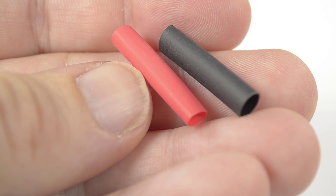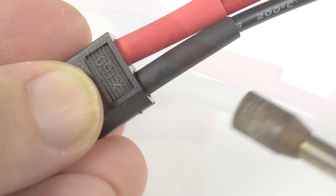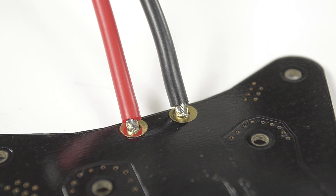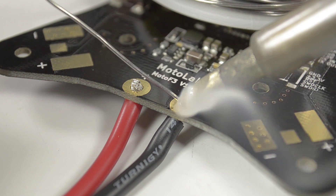The joint should be shiny with good contact but not overflowing solder. Take about an inch of four mil heat shrink and make sure it goes all the way inside the XT60s. Shrink it down, then insert the power wires to the underside of the Moto F3 and add a little weight to the top of the board to force the power wires out and solder.